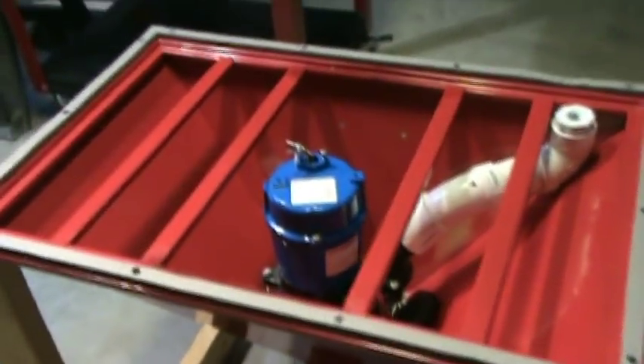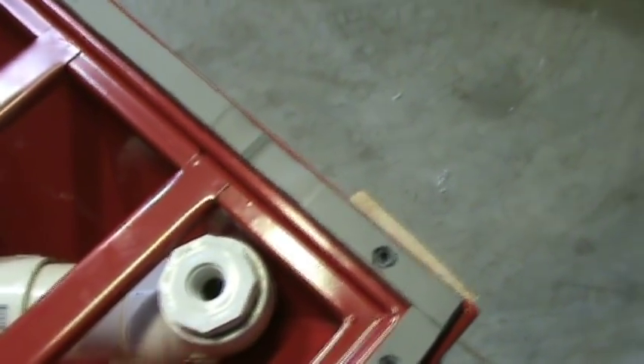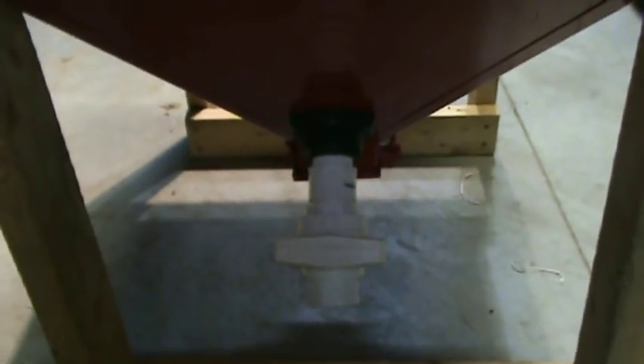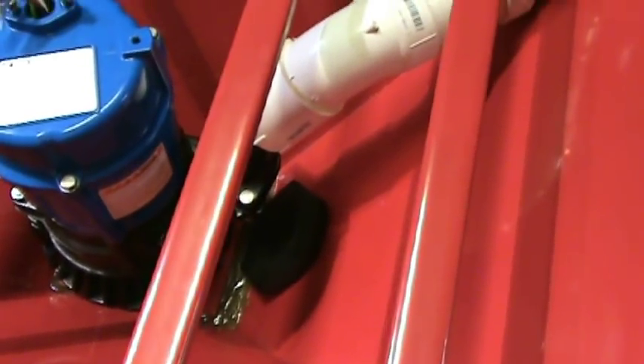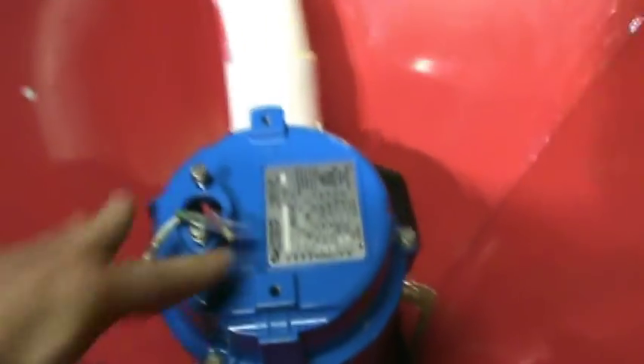The pump is now sitting in on the raised floor. I've done the plumbing off the pump, kept it two-inch all the way up level with the screen top, then it goes down to half-inch hose. I've also put in a bulkhead fitting on the bottom — a one-and-a-half-inch bulkhead fitting I got on Amazon (and later found at Northern Tool) — so when it comes time to replace the media you can get it out easily. The top rack is done; with it off you can see it sits in there very sturdy and doesn't move around.